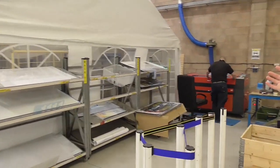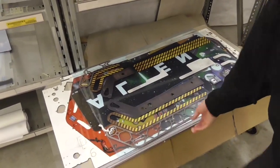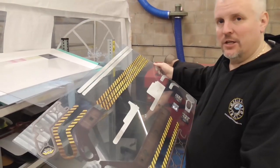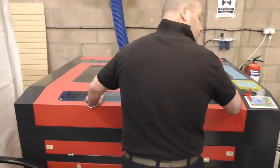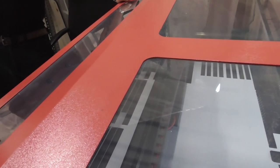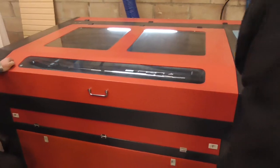So over here we have Jason who's cutting out. You'll see here these are panels which are waiting to be cut out. That's a complete plastic set — exactly, yes. These are the platforms that go on Alien. These have already been printed in the printer room next door here, and these are about to go onto a laser cutter to be cut out, and then can be installed immediately onto the game. Jason, tell us what you're cutting here. I am cutting the kicker plate — a kicker plate for one of our mechanisms. This sits in place before it's kicked out. This is part of our new eject mechanism.